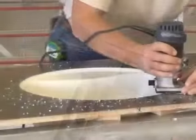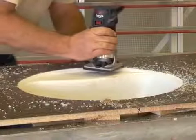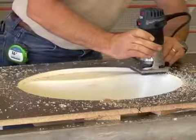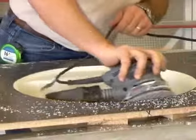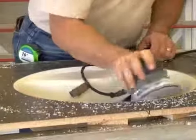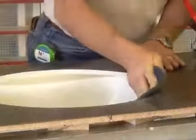Profile the laminate using the Wilsonart HD bevel profile bit with a laminate trim router. This will provide a close cut to the bevel of the sink, and in some cases slightly cutting into the sink itself. Together, these two bits will minimize tool wear and sanding in the next step. When finishing the bevel edge, use a random orbital palm sander starting with 150 grit and finish with 220 grit sandpaper. Finish out the sanded bevel using a gray 3M Scotch-Brite pad.